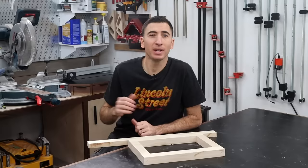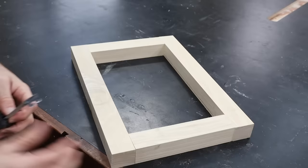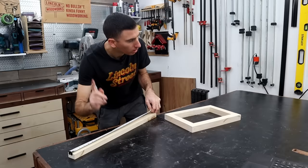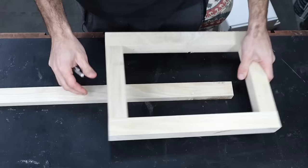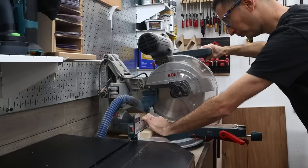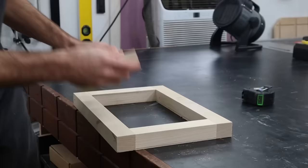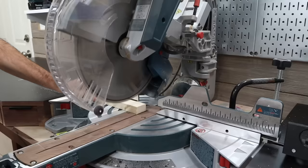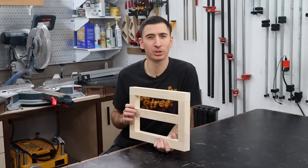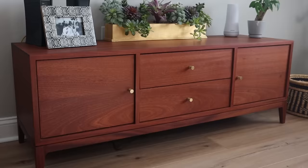Let's take a look at an even more common occurrence. Say I'm trying to perfectly fit a board in between these pieces. Instead of taking a tape measure, saying the measurement out loud, transferring the line onto your workpiece, and then double or triple checking that you said 11/16ths and not 1/16th — place the board down in between and simply draw a mark with your pencil. This is referred to as a referential measurement. Sneak up on it and test fit each time. You will waste less wood this way and save yourself time in the long run. Measure twice, cut once: great for cheesy shop signs, mostly fiction when building furniture.